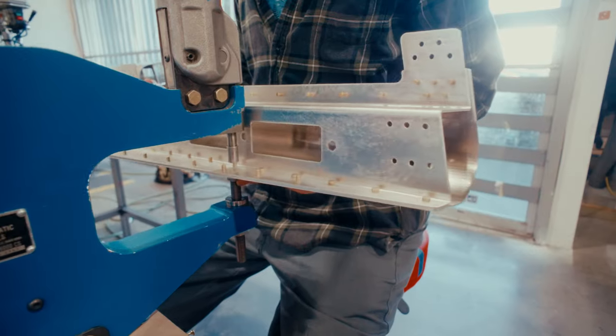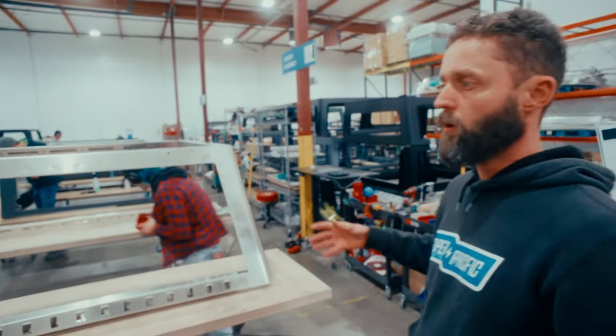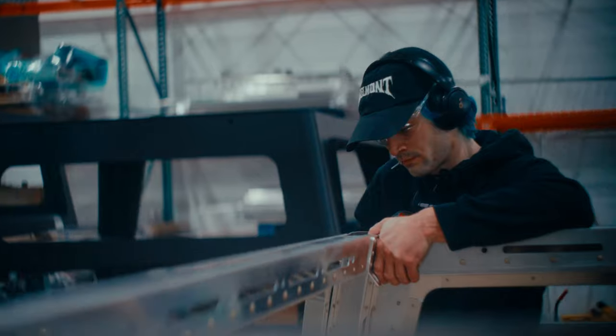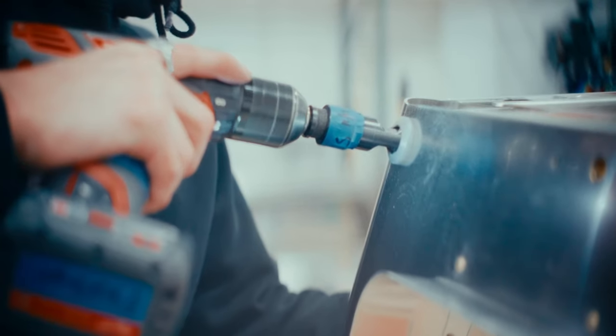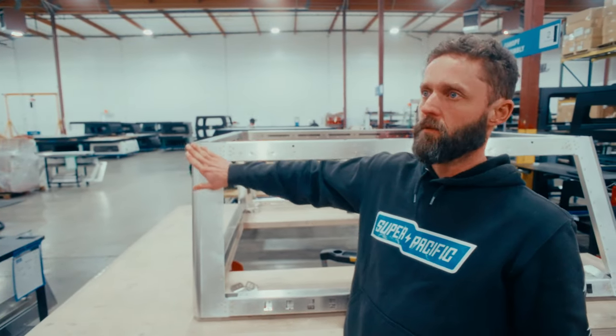So Scott is over here, he's assembling components, and Max here is starting to take those assembled components and put the fuselage together. So he's got his posts and his beams all assembled. So yeah, here we've got all of our countersunk rivets. Here, we countersink these so the skins can lay up on them. The next step in the assembly is applying the skins.